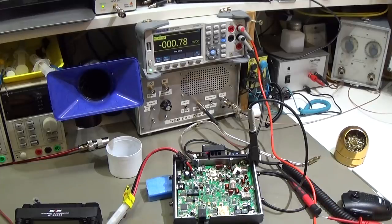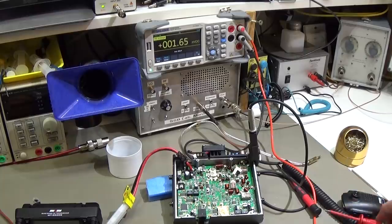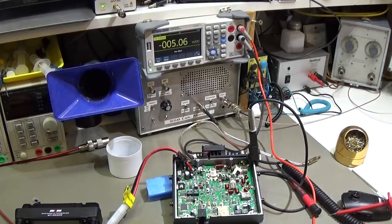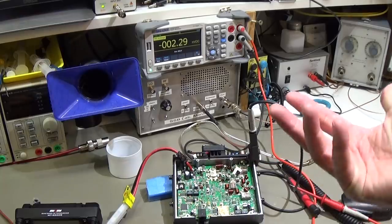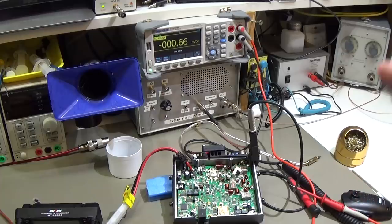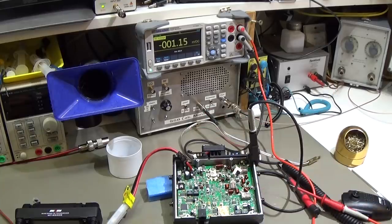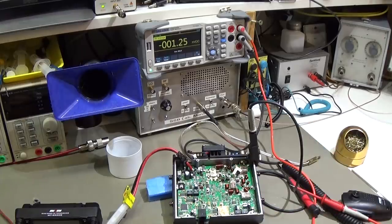According to our schematic, it should be present, even if we have a problem here with this regulator. We only tested the voltage at our R40 simply because we wanted to know if the voltage is present, because we have seen that there is a PTC in line, which I cannot find on our board, so maybe it is underneath. Therefore, as next step, I really have to take the PCB out of the housing to look underneath and see if maybe we have some burning marks, or what's going on here. Is the PTC underneath, and so on.